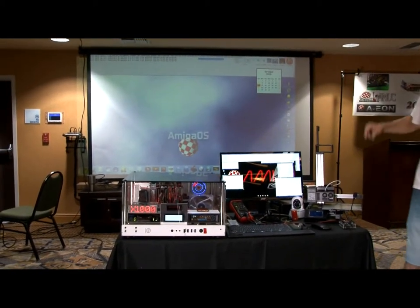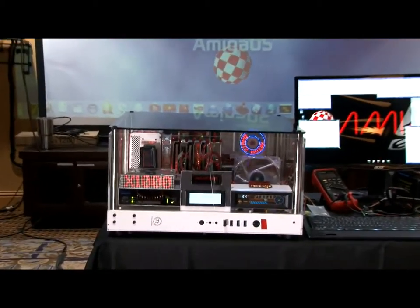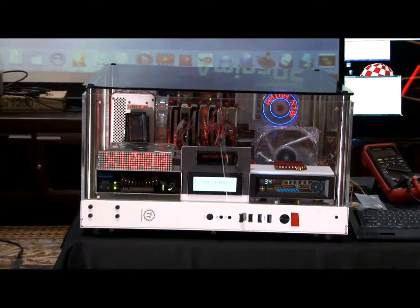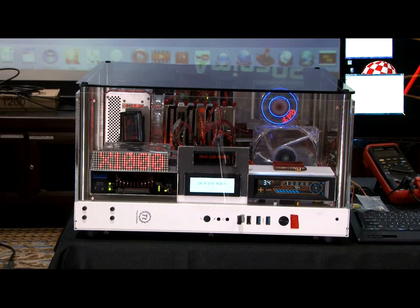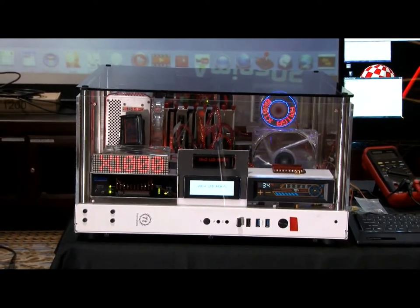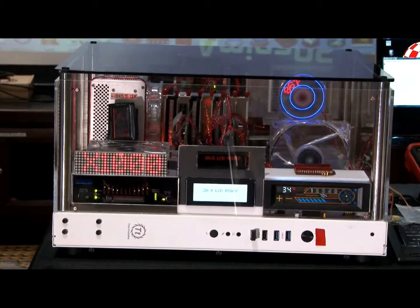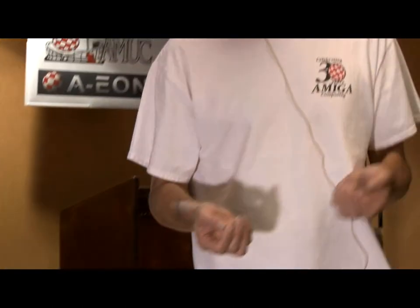You can come and look at it afterwards. It's basically two heat sinks sandwiching a flat white plate filled with little transistors. When you apply power to it, one side gets really cold and one side gets really hot. As long as you get rid of the heat, the other side stays really cold. A lot of people were asking about condensation. I found that as long as you keep the inside temperature around 70–72°F it's fine. It's only if you cool down to around 60 degrees that it starts to gather condensation. But if you fully seal the case, you can put dehumidifier packets inside, and once that moisture has been trapped, it doesn't matter if you freeze the air.